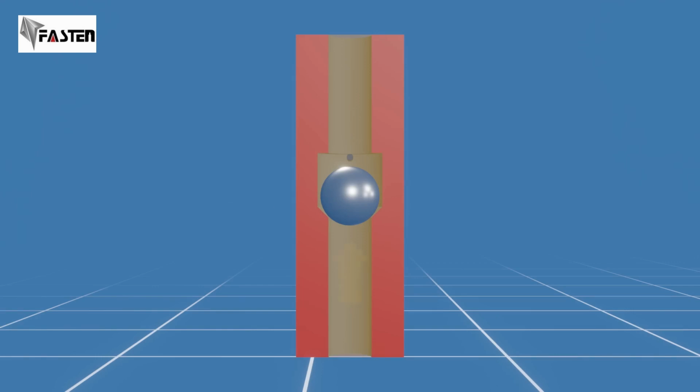When the oil pressure from the inlet side exceeds the pressure from the outlet side, the ball is dislodged from its seat, allowing fluid to flow through. When the outlet pressure exceeds the inlet pressure, the ball closes with the back pressure or with the spring, effectively closing the orifice. A free-floating ball check valve requires a reverse flow or gravity to move the ball against the seat to seal it.